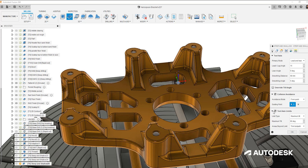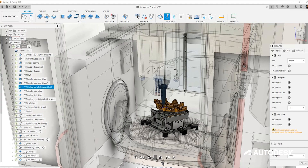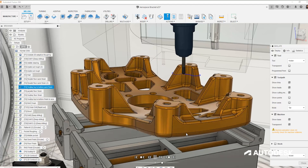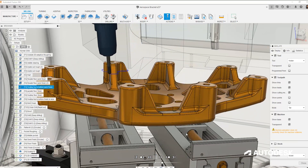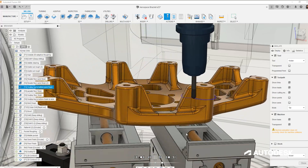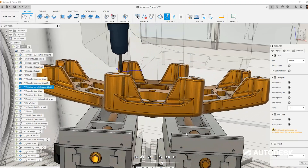The ability to limit the tool axis here gives you control over the maximum tilt angles used during collision avoidance. On machines like ours where the table can get close to the spindle shroud, this parameter lets you specify the maximum tilt angle, removing the need for multiple setups with various tool axes and removing marks that can be seen on the surface where toolpaths overlap at different angles. Steep and shallow with its finite strategy control and additional tool axis preferences gives you the control you need over finishing complex, feature-rich components.